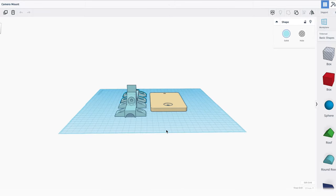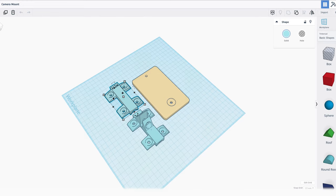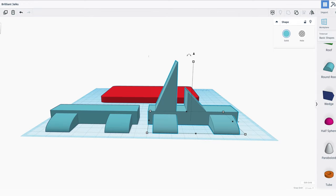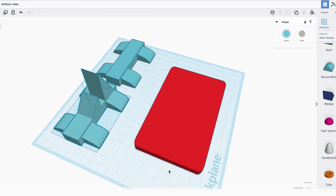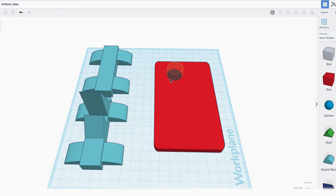We still have the mounting holes and the relief for the body of the clamp so that they could sit properly on the pole. And now let's go ahead and create the holes for the bolts. I'm doing 10 millimeter. I'm just picking an arbitrary height. It doesn't really matter. I like to keep it smooth, so I max out the sides here.